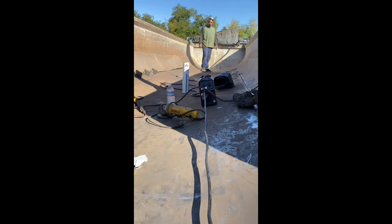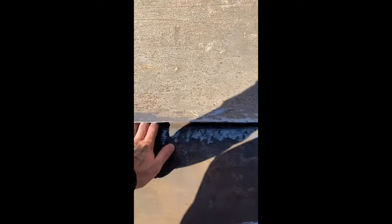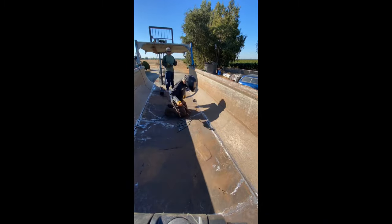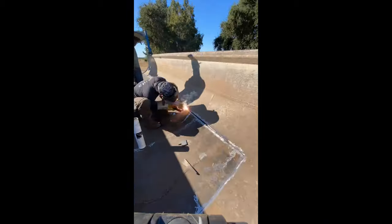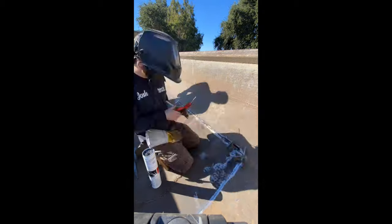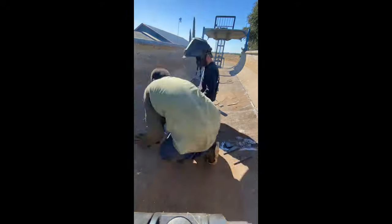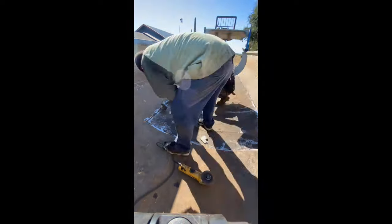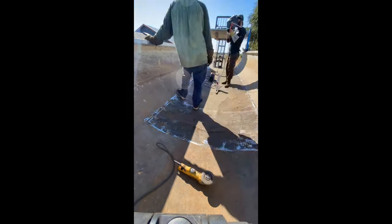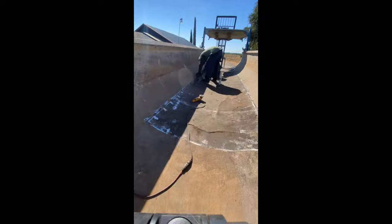The upper portion of the liner that we left stuck out a good ways and there was quite a bit of gap, so we had to dog and wedge everything. The gap was big enough to fit my hand in most places except for the weld seams where the plates were originally welded together. Before we could proceed any farther we had to get this old liner back welded down to the floor using the dog and wedge method. If you've never done that before it's a lifesaver, but it's super time consuming. I'm going to make a how-to video on the basics of using a dog and wedge, how to make them, and probably put in a CNC file for anybody who needs it. It's basically a way of manipulating your plate to lay flat.